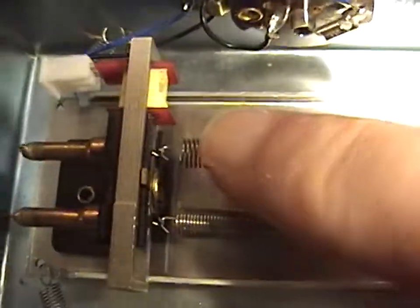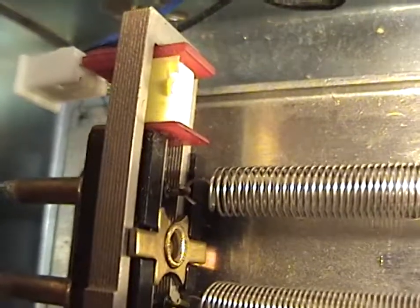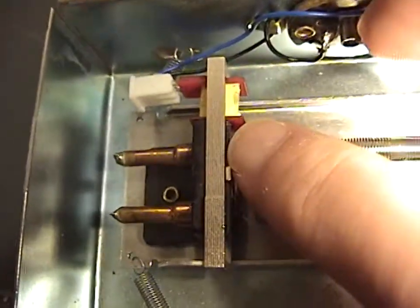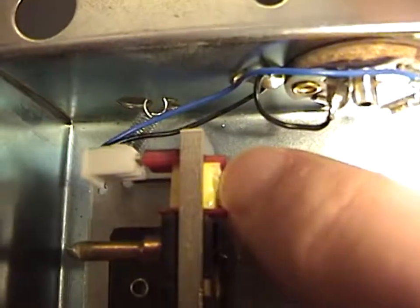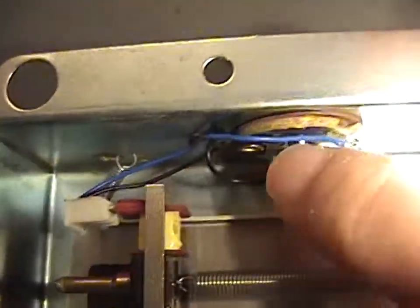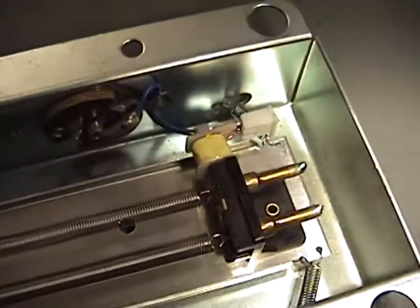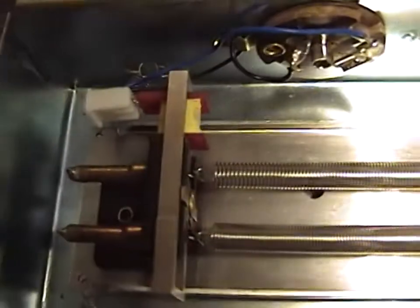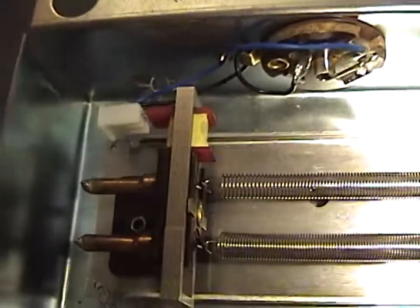Well, the motion is picked up over on this end, so there's little magnets over here as well that the springs are anchored to. And when this end of the spring moves, it moves a magnet, which creates a magnetic field in this lamination, which gets picked up by this coil and then travels to your output jack as sound. So this end's doing the opposite of what this end does. This end takes in sound to create magnetic force to move the springs, and then this end uses motion to create a magnetic field which travels over the output jack.